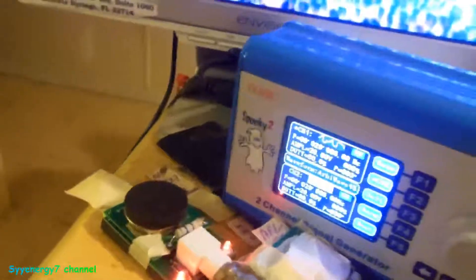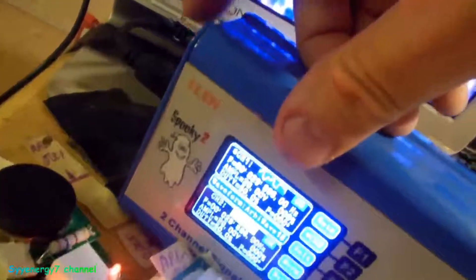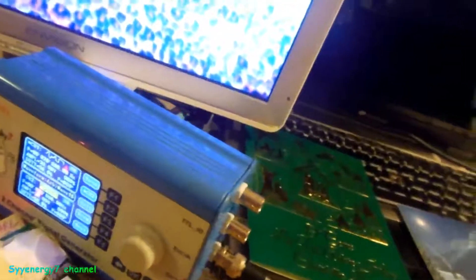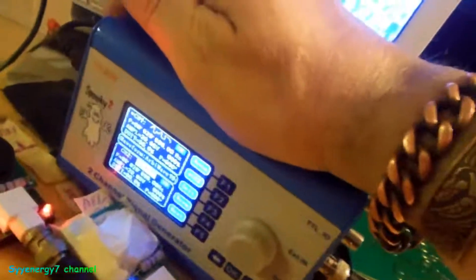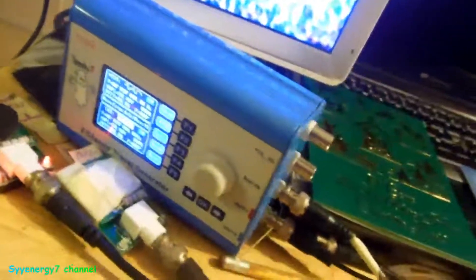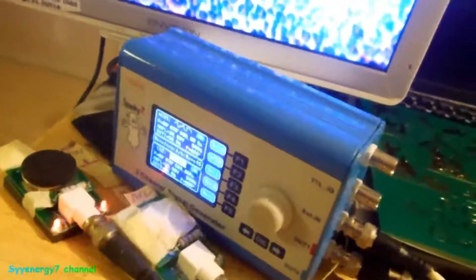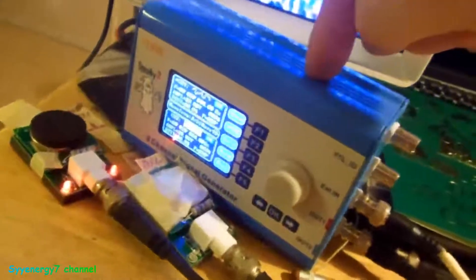Here's the real reason why you probably have a problem: you've got a USB connection and you've got the power. This has to be powered by the wall socket or a battery backup power strip — it has to be powered from the 115 volt household current, and not just from the USB.